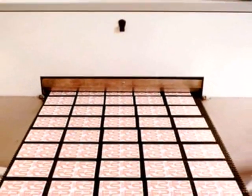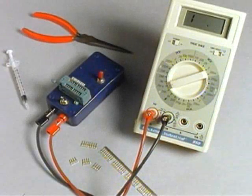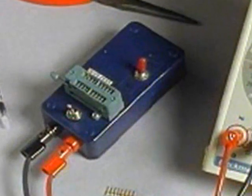The unencapsulated resistors used in this test were manufactured at IRC's Advanced Film Division. The test apparatus was designed by IRC application engineers to hold the resistor securely while providing an electric potential supplied by a standard 9V battery.